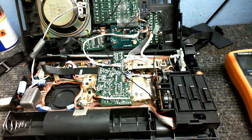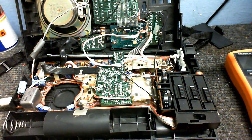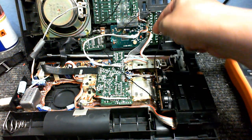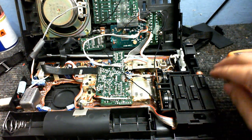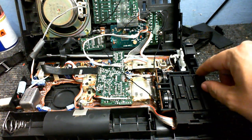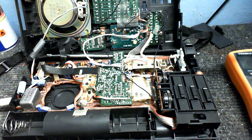I've replaced that broken ribbon cable with these two cables here. I couldn't find an eight-cable ribbon cable, so I've taken a couple of four-way ones and soldered those onto where the original cable was. And guess what — nothing. Absolutely nothing. It's on right now — won't tune into any stations, nothing on the display, nothing coming out of the speaker. I think this might be one of those episodes where I just don't manage to fix it.